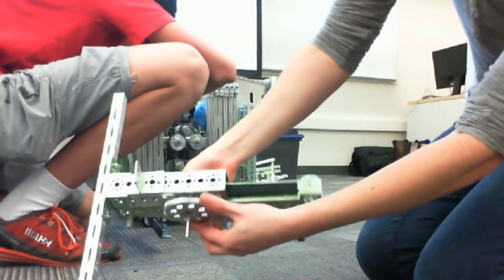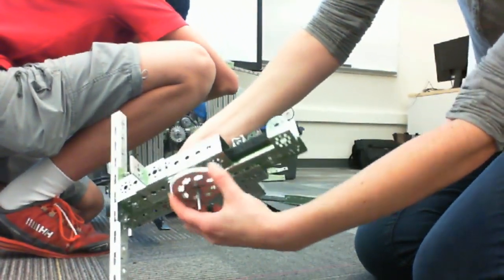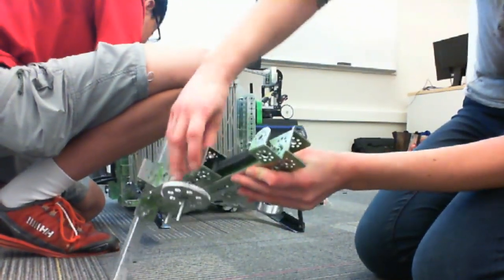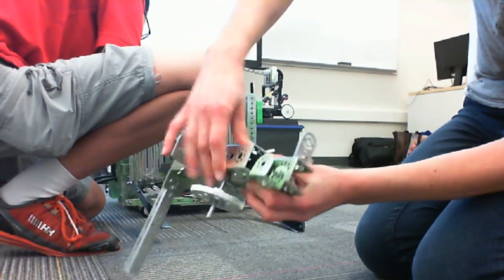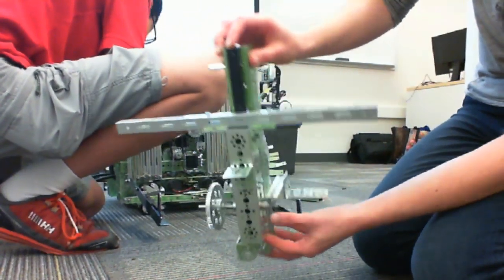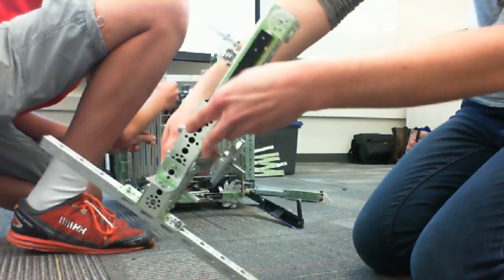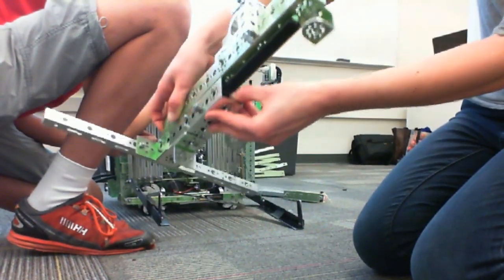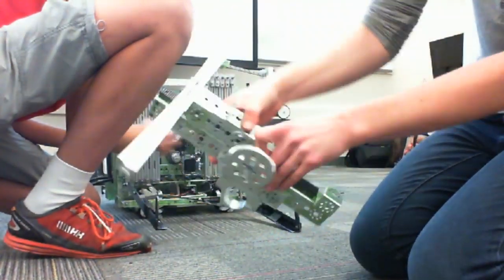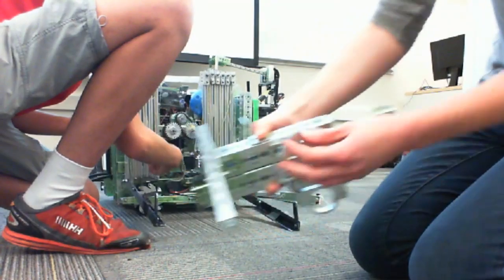So the motor will be attached, with a gear to spin this one. I just got it moving back and forth here. You can see it there. It's got a gear rack made out of plastic with little hooks on this side to keep it on. That's why these sections are not very long. If you want to go further, you have to get multiple sections, and then you run into issues with the little clamps getting caught between them, which is why you can really only use this method in small sections. And then each section needs its own motor. But for the small sections, it works really, really well.